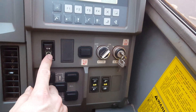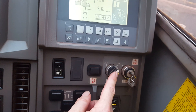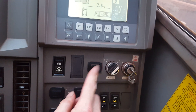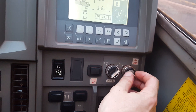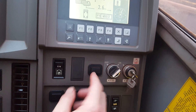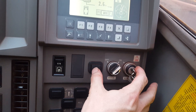You've got your slew brake here, it's a little slew brake. You've got your PTO here. When you need to turn the crane on and this computer on, you have to turn the PTO on. That starts it up and gets the crane ready for crane lifts. Now these are your alarms. This is your override, and that's another override. So when you pack up the crane and you need to pull the hooks up through the two blocks, you hold on to that or you turn that. Those are the two override buttons.